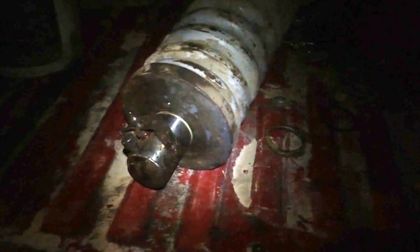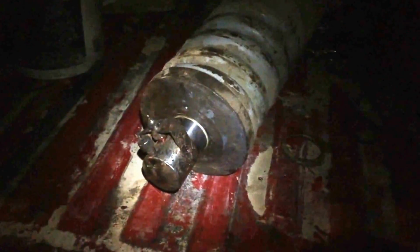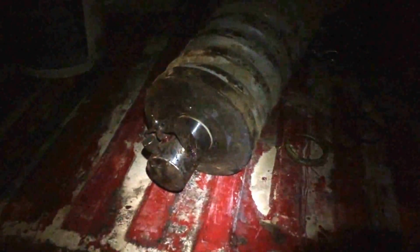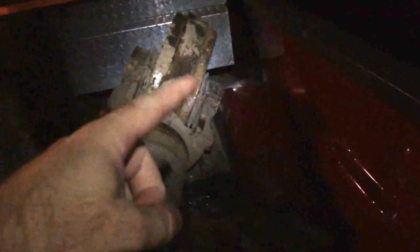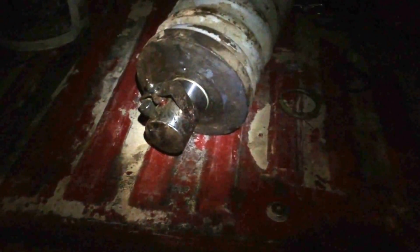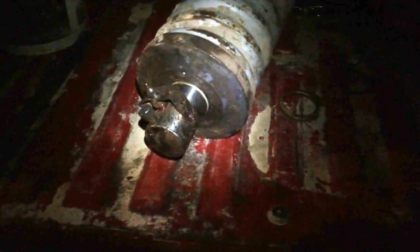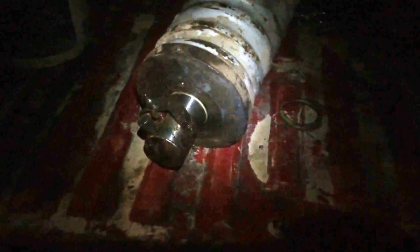Now, when I pulled this out of the machine, looking at the back end here, it looked to me like that cylinder could just slide right out. And it kind of made sense to me that it could, because when it's on the machine, the only thing that holds this whole slack adjuster in place is the track that goes around the outside end of your idler, and this end is against a brace. So unlike a hydraulic cylinder, this thing can't really pump itself apart unless your track is way too long. So my thought was, hey, maybe this cylinder will just pull right out.